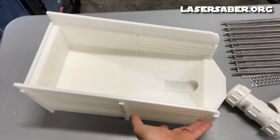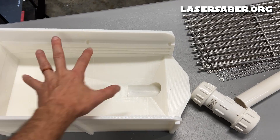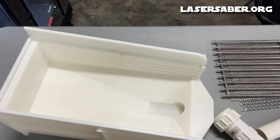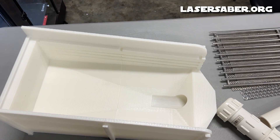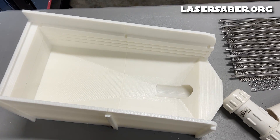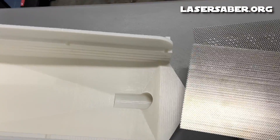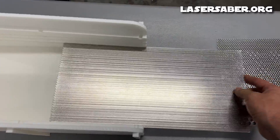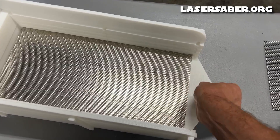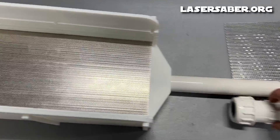This will be set in concrete with the spring catch up here on the backside, and the water will flow into this and get caught down into the pipe that leads to the water tanks. The system should classify out the rocks, smaller rocks, and even chunky sand, so that the only thing that can get into the pipe is water — maybe a little bit of silt which we can clean out of the tank when it builds up. To assemble it, you put the most fine mesh here on the bottom, slide it in — there's a little indent to keep them in place. The pipe will be mounted into here and then this connects and runs down to the spring.